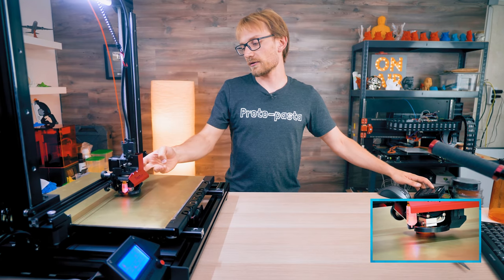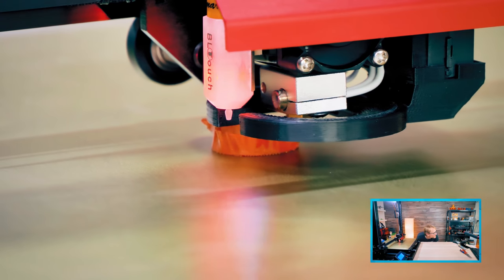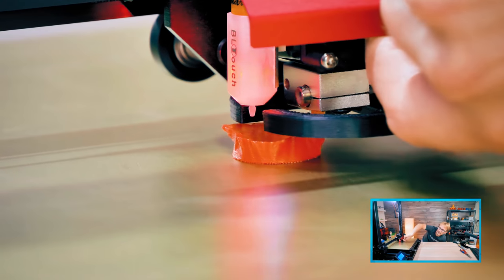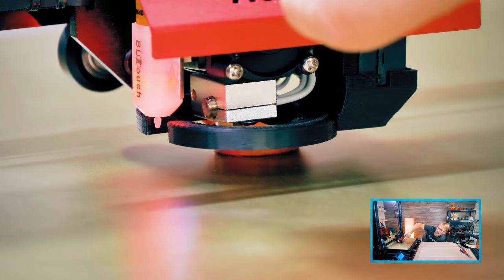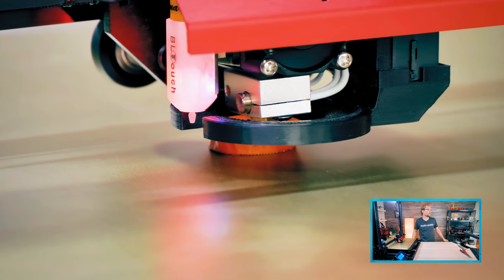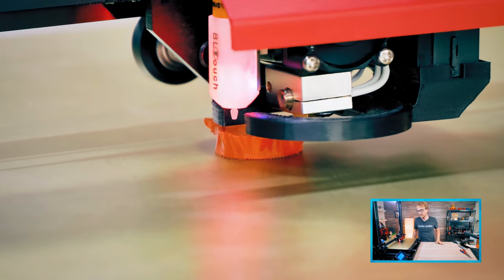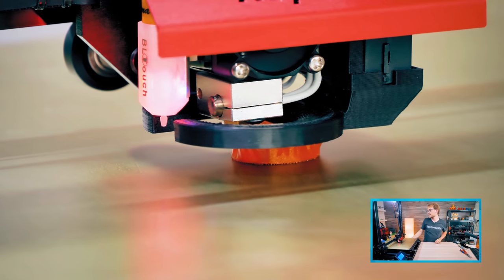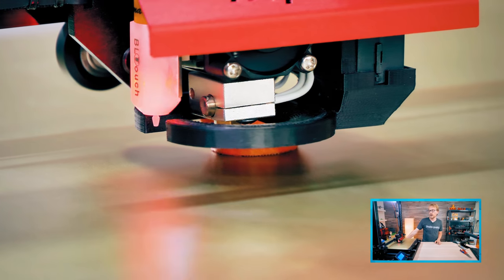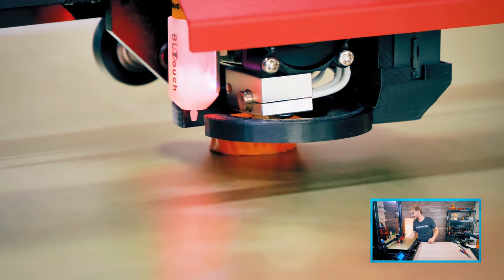The thing that I'm hearing right now though is, well, that fan's not doing anything. Thought we kept this one always on. The hot end fan. If I just quickly, I'm hoping you can hear the difference in noise there. So the hot end fan is really, really loud. Maybe grab the same fan as in the Mark III, use the Noctua 40 millimeter fan. That would make this printer massively better in the sound department. Just make it a lot quieter. As is, it is quieter than most printers with standard Allegro drivers simply because the motion doesn't make that much noise, but the fan is kind of annoying, to be honest.